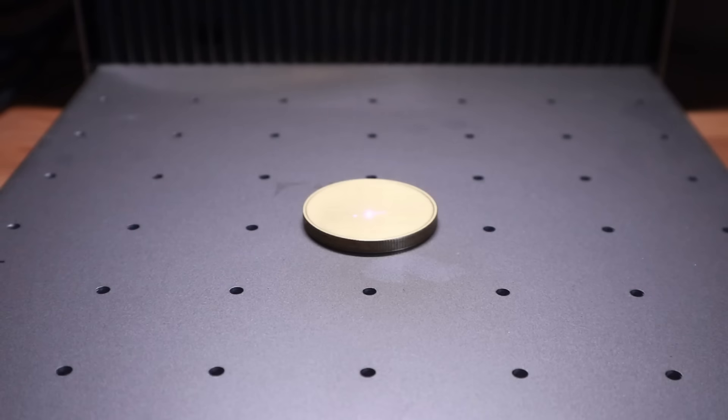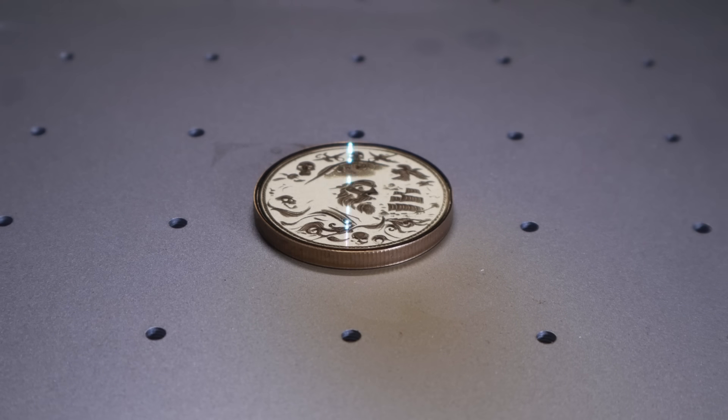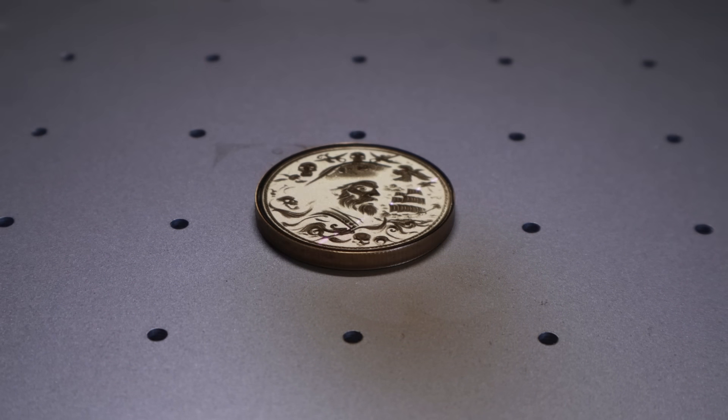That is because we're going to do some embossing on it, using depth map images again. I've used AI in the Xtool Creative Software to produce the coin image. When it first starts its embossing process on the coin, you could watch it for at least 45 minutes and you won't see anything change. But then not long after that, you start to see the shape of the coin appear. What you're seeing now is after about two hours of embossing. This coin took three and a half hours to emboss and it has come out great. However, it hasn't got all the detail in it that the picture had — although three and a half hours sounds a long time, I actually ran it a little bit too quick. So I reran the test and this one took five and a half hours — much better. A blank brass coin blank costs about £2 to £2.50, so they're not the dearest of things to produce.